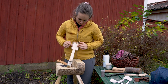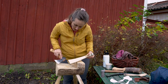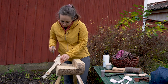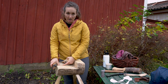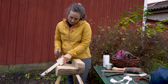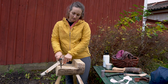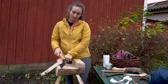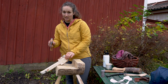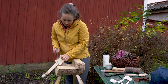I want to take off these pieces on the side. So this isn't quite wide enough here, but there's a notch here in my axe block, and I can rest my spoon in there because I want to keep the axe as much at a right angle to the axe block, and not necessarily to the piece. I want to move the piece and not the axe and go sideways as much as I can. So my axe is straight and I can cut down